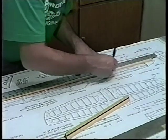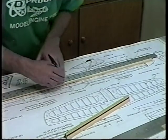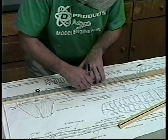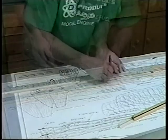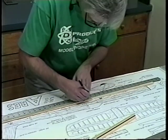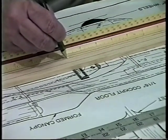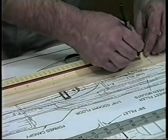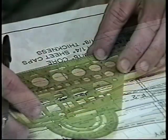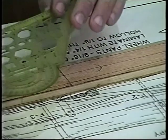Now, using the straight edge, connect the ends of the parallel lines with the corresponding tip marks. This operation will require you to draw 4 accurate lines. Mark the inboard spar for the lead-out clearance slot. This slot should be no more than 3/32 inch wide. Using a circle template, mark a 1/2 inch diameter semicircle at each end of what will become the bell crank clearance slot.